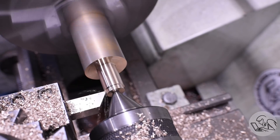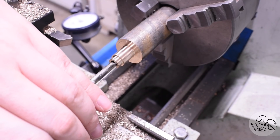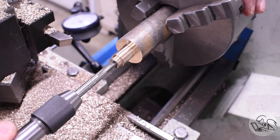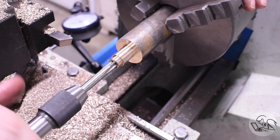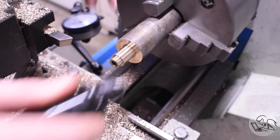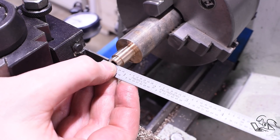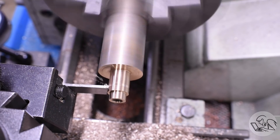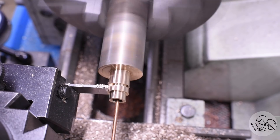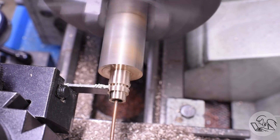I'm sneaking up on the dimension for the first one here, which will save me time later. Once I get the dimension perfect I make a note of the cross slide hand wheel setting and go ahead and tap those threads. I drilled deep enough for all four bushings and I'm tapping as far as I can - my tap is only long enough for two at once, but I'll tap all the way down. So I have four bushings drilled and two of them tapped. Then I part this off to length using the same method as before. By making them two at a time, I'm leveraging the thickness of my stock and I've maintained concentricity throughout all of these steps.